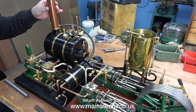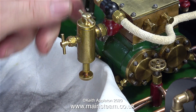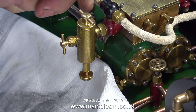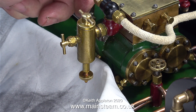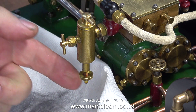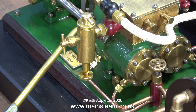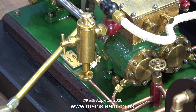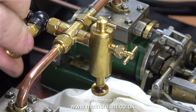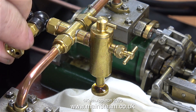I'm temporarily fitting the piece of silicone rubber between the condenser and the chimney. I've lit the boiler — that's the noise you can hear in the background — and now I'm opening the bottom valve on the displacement lubricator to drain off the water. I was surprised to see how little water came out of the lubricator, but then again in the last steaming it wasn't running for very long.